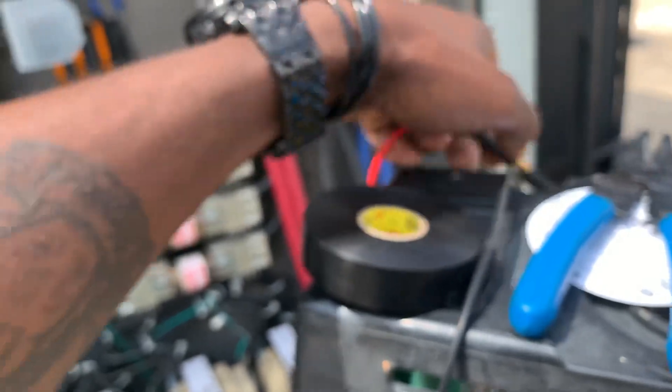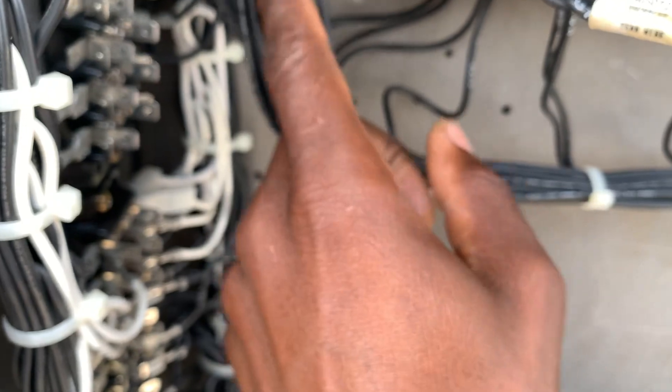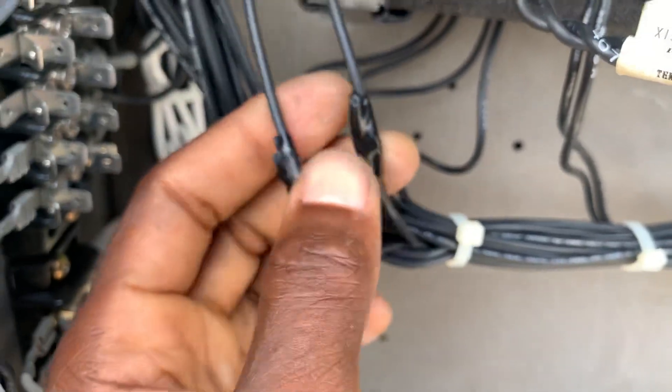So I anticipated that there's probably an intermittent short — a very light short to ground — on one of the wires going to the thermistor. So I tested with my meter from the terminal. These are the two wires right here. This is what I did — real time, I tested with my meter.